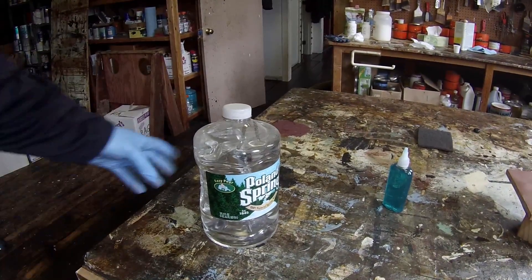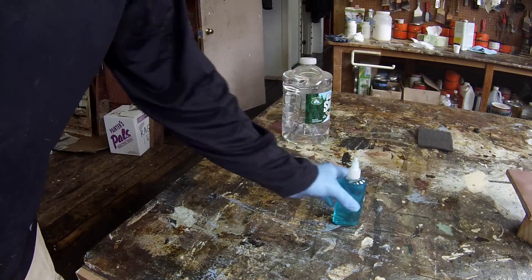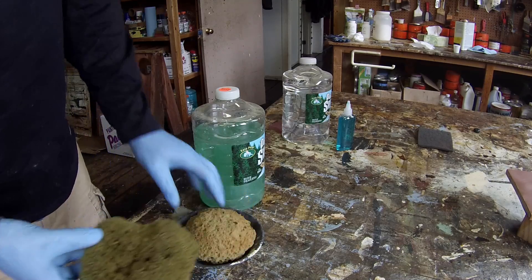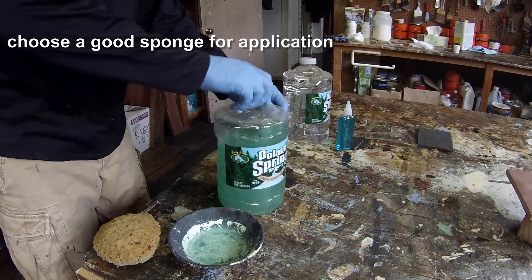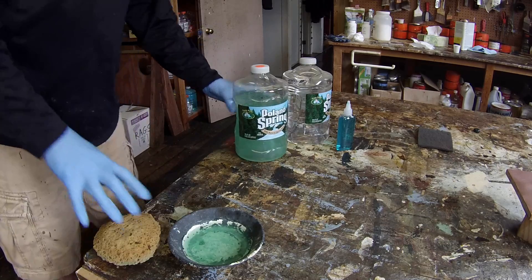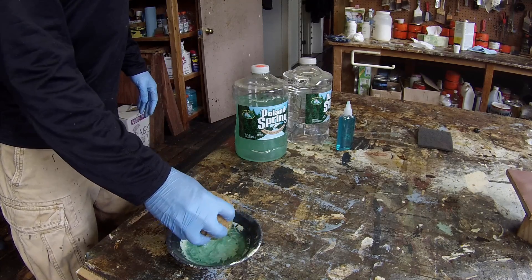The patina I'll be selling comes in concentrated form. This tiny bottle mixes with one gallon of water to produce the solution at the proper concentration. To apply the patina, I use a sponge — a natural sea sponge works best if you can find one with a decent shape and even texture. Lately I've been using a synthetic sponge and it's been working well. Avoid using a brush or a rag because the patina develops fairly quickly and you need more control to get it to blend in right.